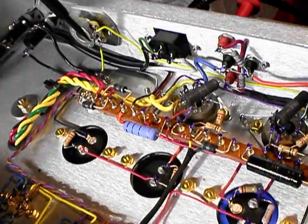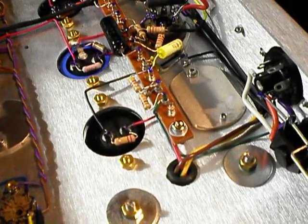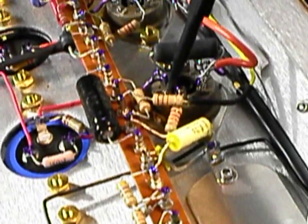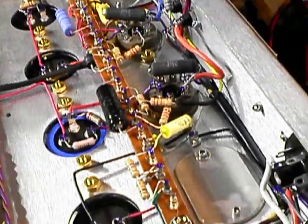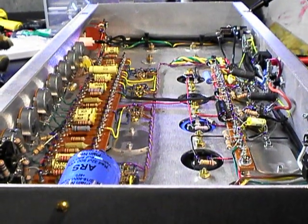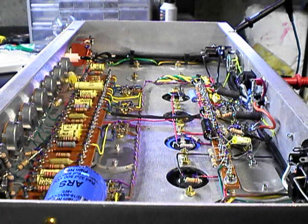There's my pot. I've wired that in series with the bias resistor on the preamp board. Lessons learned: I used a 10K sweep trim pot I had kicking around, but what you really should use is more like a 50K sweep. It gives you more adjustability. I'm able to get away with just a 10K sweep, but I recommend a 50K just to have more adjustability.